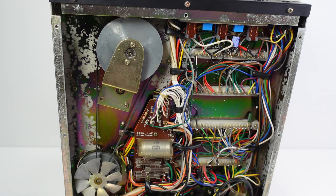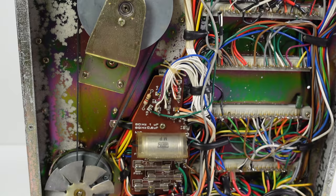You might remember this - the HiPak player, the background music machine. When I made the video about this, we found out it was playing slow, and inside there was a capacitor that could be swapped out depending upon 60 Hz or 50 Hz. I asked the question: will swapping this capacitor change the speed, or is this just something that should be changed once you've replaced something else? Does the capacitor affect the speed?